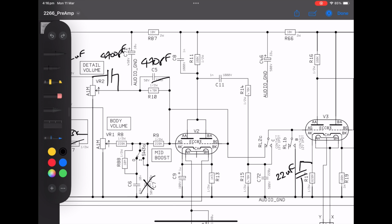And what happens in a parallel gain stage is you have twice the current. So if you want to have the same amount of gain as a 100K plate load on a regular triode, look at R16 here, right? 100K plate load on a single triode, V3A. You see this stuff all day long in a Marshall. Well, because this is a parallel stage here in V2 and we've still got 100K here, it's kind of like having 200K in a single triode.